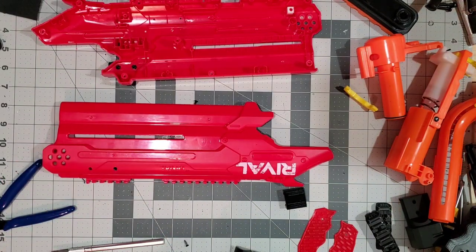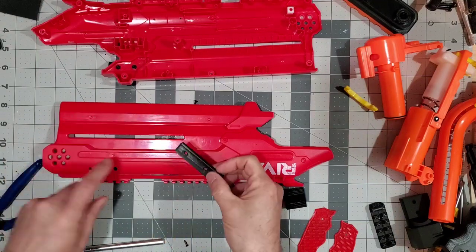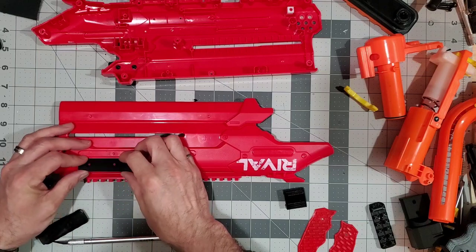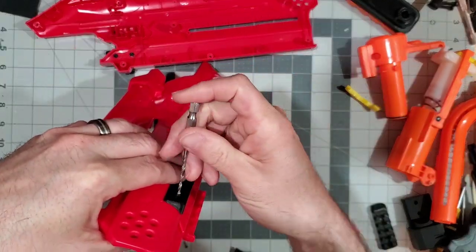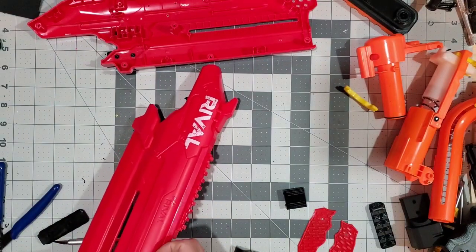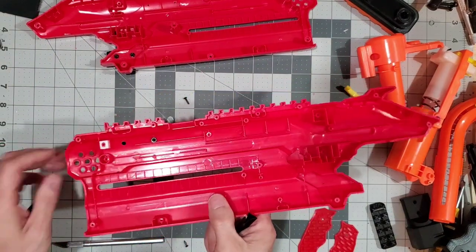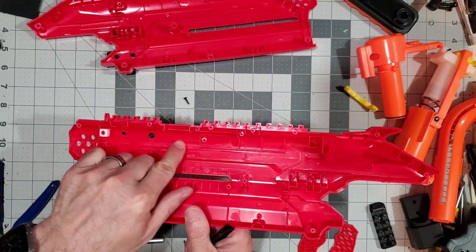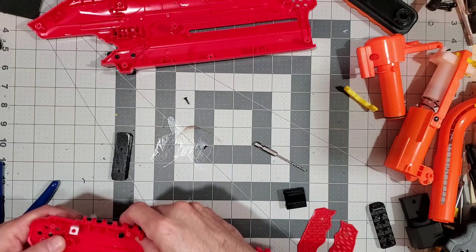We'll go over some of the quick easy external mods. When you order the tactical rail for the shell, it's contoured to this part of the shell. When you do your installation, make sure you line it up and hold it in place, then take a hand drill and drill down through. These use M3 bolts which come included. One thing to keep in mind is to stay above this internal fin so the installation does not interfere with the movement of the bolt sled.